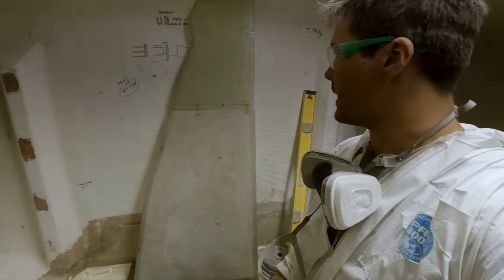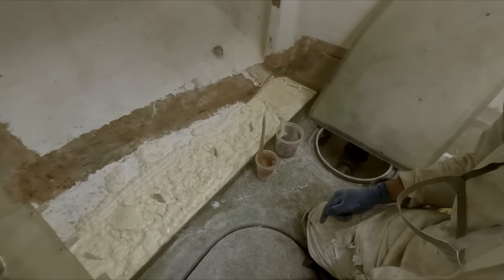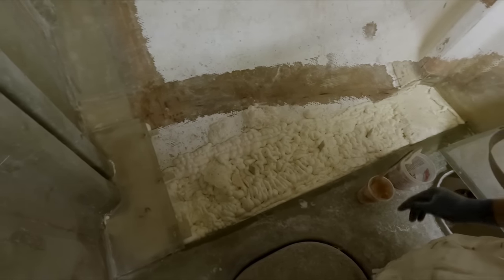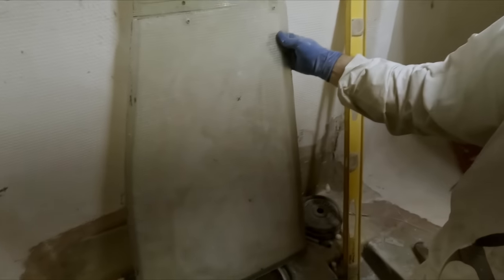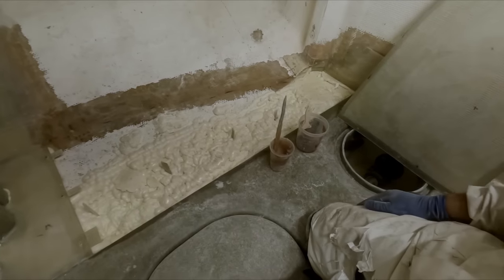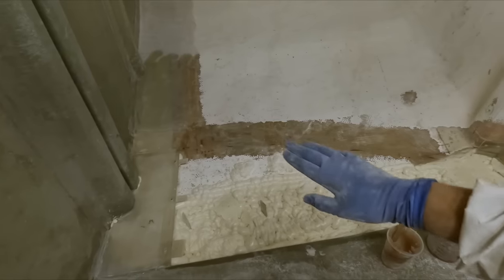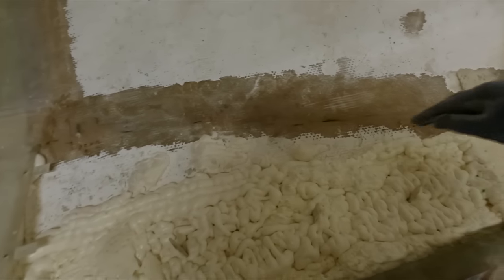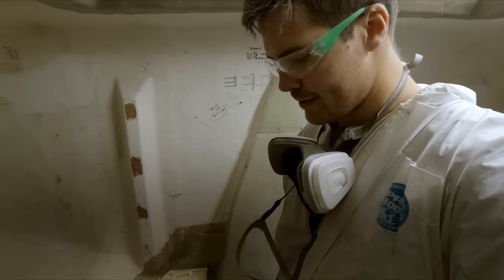All right, everyone, pretty exciting moment about to happen. I'll go over it quick because my pot's already cooking. We've been foaming in the side sump here. Actually, it's not even a sump, it's just been a void. That's the last exposed foam. We got a laminated, just a thin couple layers of 90, and that's gonna be going over the top of this, after which it's glued down, we'll tab it in just lightly, poke holes in it, spray foam through it, filling out the rest of this void. And that'll be the last ugliness covered up.